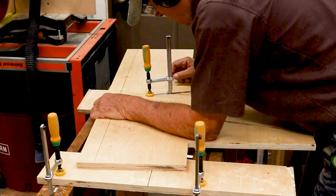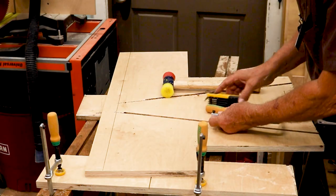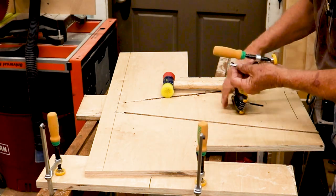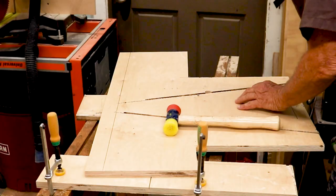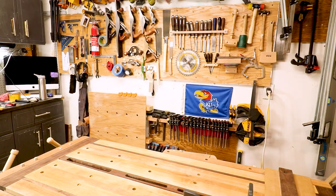I started by putting in two dovetail slots at an angle off-camera, and what I'm demonstrating here is that with these match fit clamps you can take off the little holding piece on top, turn the clamp around, and then have the hold-down piece extend further than your slot.